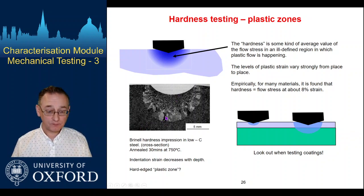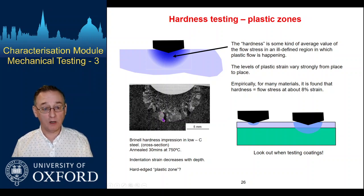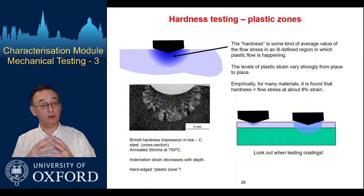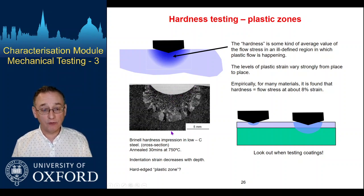In the low strain region, you get relatively few places where a new crystal orientation will nucleate and grow, so things have a rather coarse grain structure — few nuclei, but they grow out to impinge on each other and are quite large. Whereas closer to the indent, where there's lots of strain, there are lots of nucleation sites for recrystallization, so you don't get large grains. Essentially, the outer periphery of the recrystallized region tells you the extent of the plastic zone. You can see it's gone several times deeper than the indent itself, and it spreads laterally but not as much as in the depth direction.